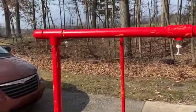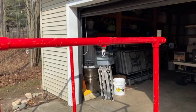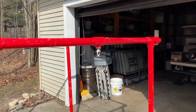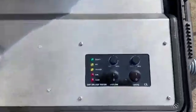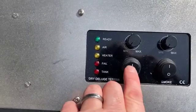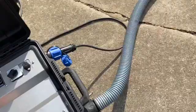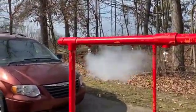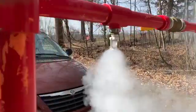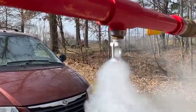We will discharge vapor through these sprinkler heads, demonstrating how some of them are blocked, some of them are bent, and some of them are partially blocked. We will turn on the air and the vapor or smoke, and wait for it to discharge. Now this head is having a proper flow and proper pattern — this head would be fine.